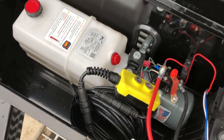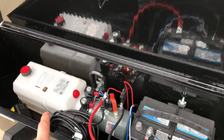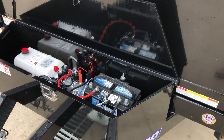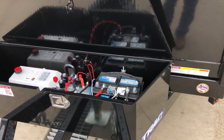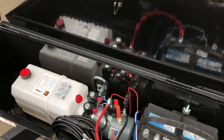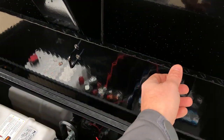The pump takes about 200 amps to run. If the battery is dead, you're not dumping this trailer. That said, if you do get it all the way up, you can get the bed down — contrary to what some folks will tell you. Coils only take about 2 to 10 amps to run, so if you've got a little bit of juice in the battery, even if the bed's up, you will get it down. This is a power-up, power-down system, which is why we have two coils. If you don't have power to push it down, it's going to free-fall — gravity down. All it needs is one coil to open to allow it to do so. That extra fluid drains back into the reservoir and may eventually overflow out the red cap, so when you put it back up after fully charging the battery, you'll need a little more fluid.